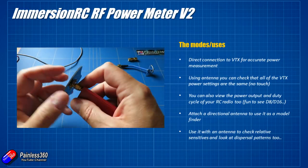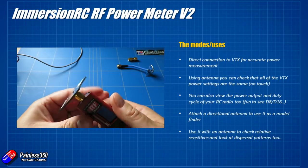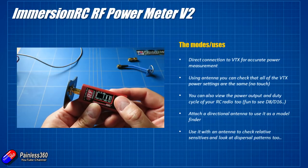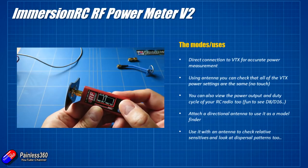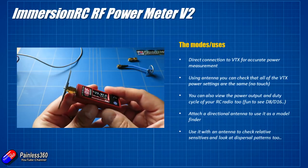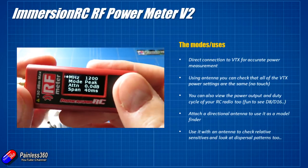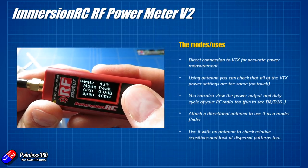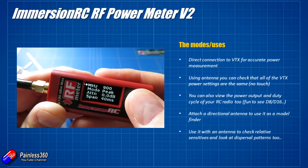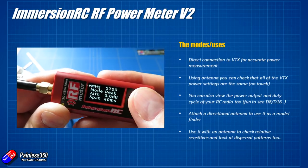The last thing that's useful for is checking relative sensitivities of different antennas. I'm going to use this in a video in a couple of days to do some testing on a new antenna from one of my favourite antenna suppliers. It means I can not only talk anecdotally about how much better it seems to be performing, but I can use the RF Power Meter to show you some objective tests rather than just subjective ones. You can see exactly how much more sensitive it is by looking at the decibel reading on the screen. By moving the RF meter around an antenna, it'll also give you a good idea of the dispersal patterns and the drop-off for directional antennas, so you have a very good idea of what the actual cone of reception looks like.